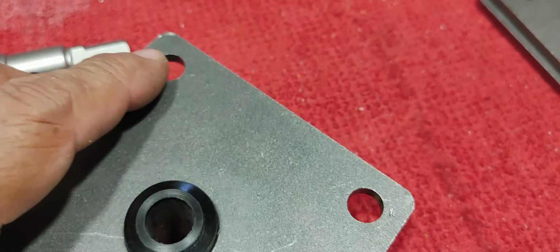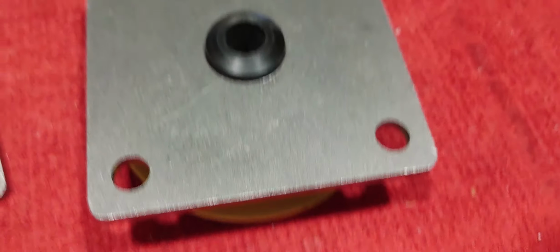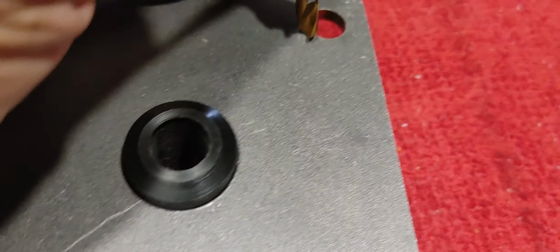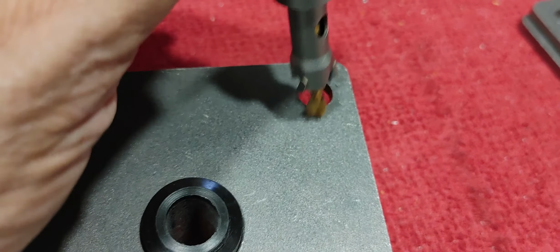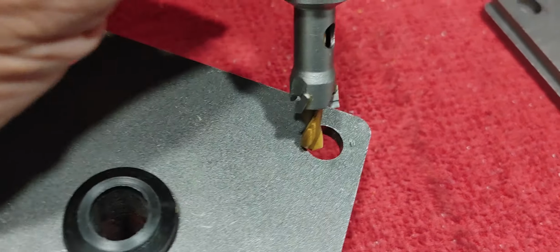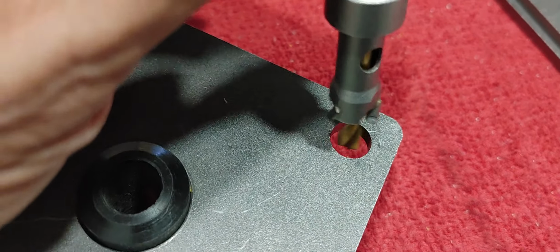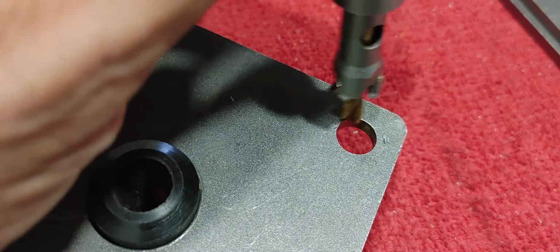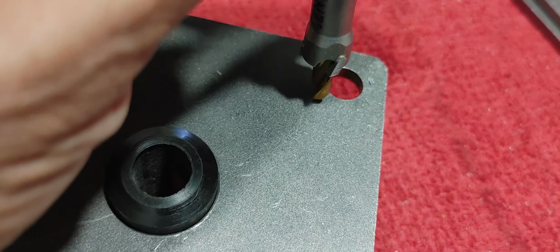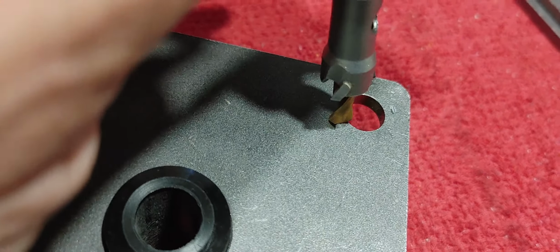dropping some metal here, using the welder, I think that's one way to do this, and I think that's the way I'm going to do it, because there's no way that I want to drill this with this right here, when the drill bit has to get started on the edge of this. You'll never get this right. So this has to be filled with metal and sanded flat or ground flat, so this has a good point of contact and reference to start from.